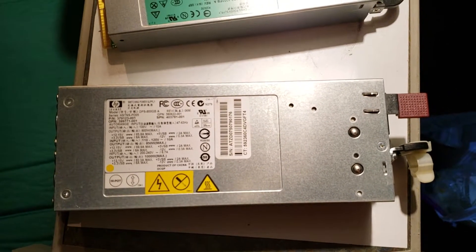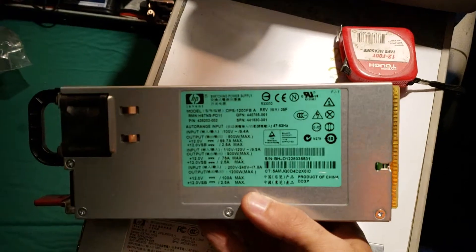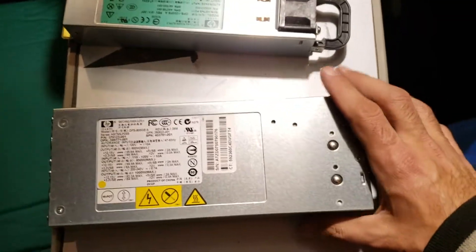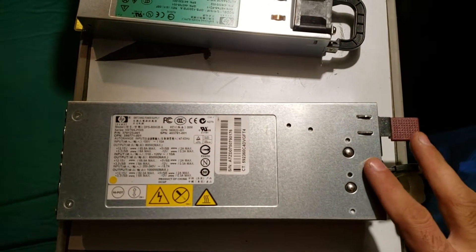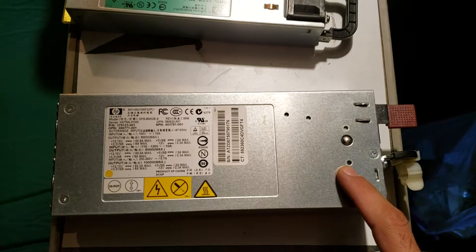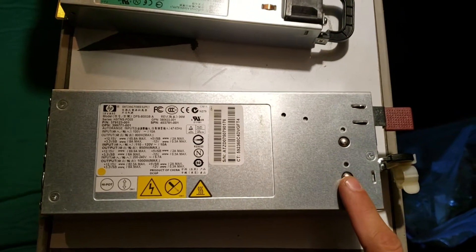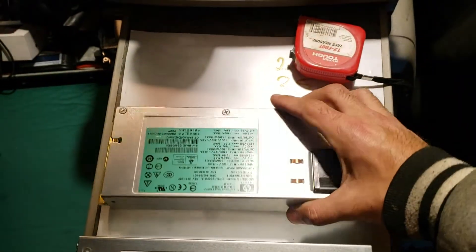You can take the 800 GB up to 16 volts. There's a video on YouTube showing how to adjust the voltage anywhere between 11 to 20 volts, but to reach 20 volts you have to change some capacitors inside, because they're only rated for 16 volts and would blow if you exceed that without the modification.